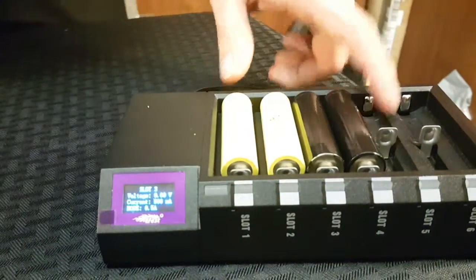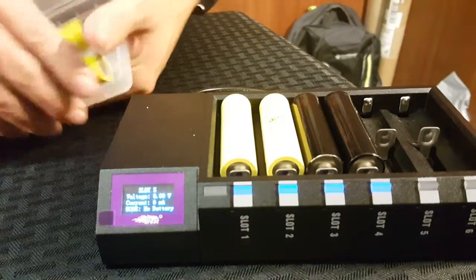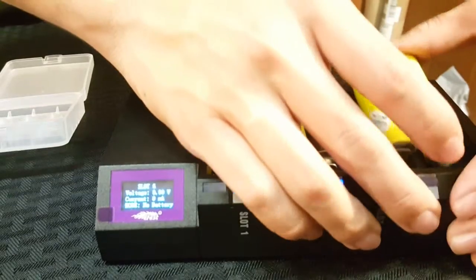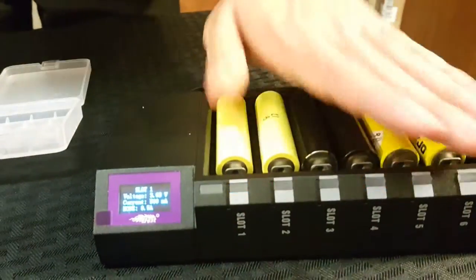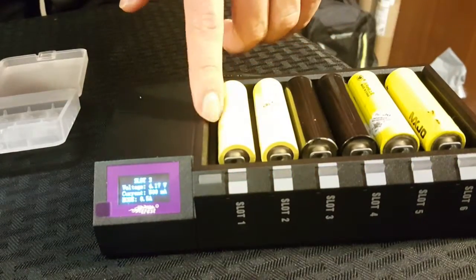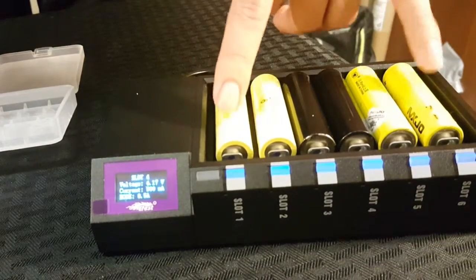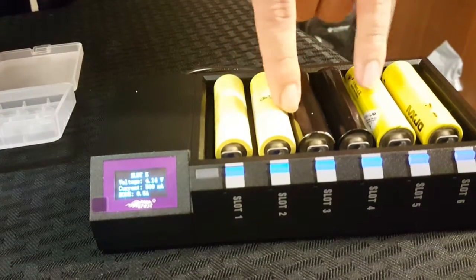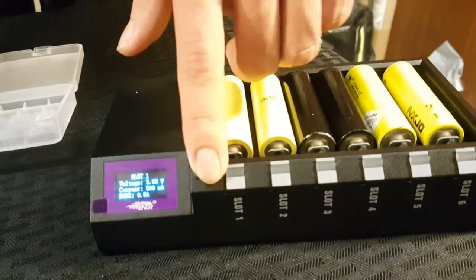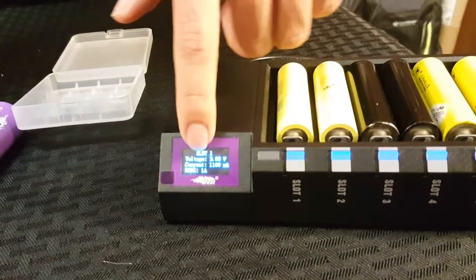While I'm putting on these batteries, also, these guys charge all the batteries that you can ask for. We got button tops, stuff like that, everything. So, if you notice, we have all the batteries on here. This guy can only charge 4 amps total of itself. So even though you put these guys at 2 amps, it will not charge any of these. But actually, it has a little protection to it. So let's go ahead and see if it actually does it this time. Ah, see, it's already cycling.